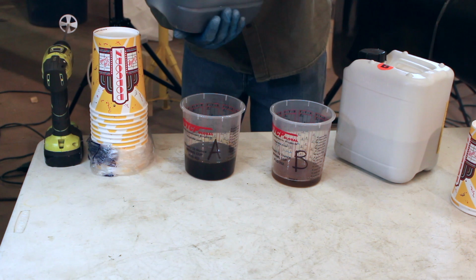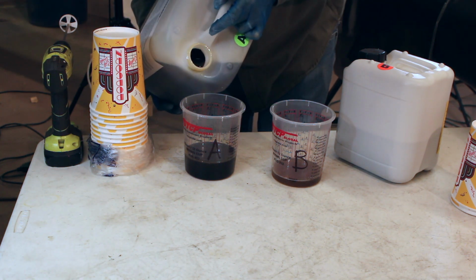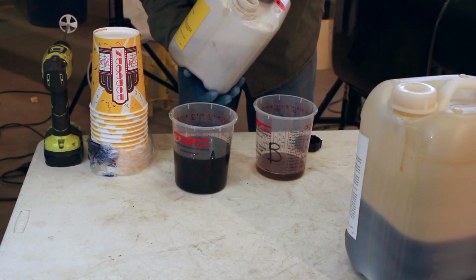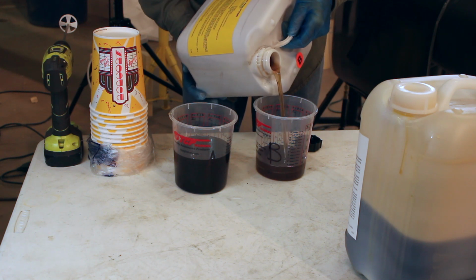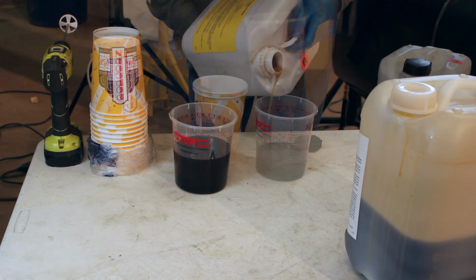Mix the foam by using the supplied instruction calculations. Note, a cup means 8 ounces and not a full supplied paper cup. These paper cups are for mixing and pouring purposes only. Home Depot and other hardware stores sell clear plastic cups with accurate measuring lines on them.